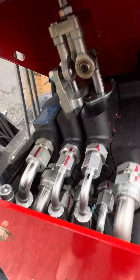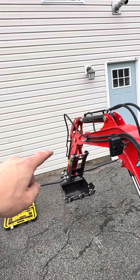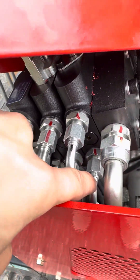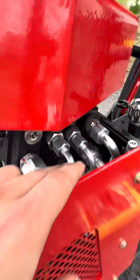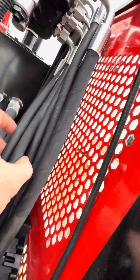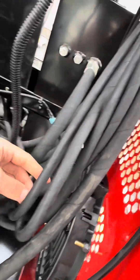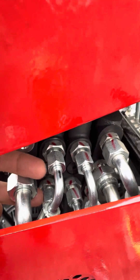Then you swap them with what you want. Over here, this did the turntable and this did the stick — the outer part. I wanted that swapped over to the other side. So you mark the top and bottom of this one and reroute them down through here, under the table, and they come around back into the block. Same thing on the other side — take this one off the top, this one off the bottom, route these two under and through. That goes out to the boom — basically flip-flopping these two connections, top and bottom, with top and bottom on the other side.